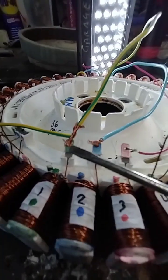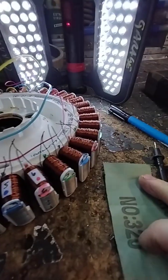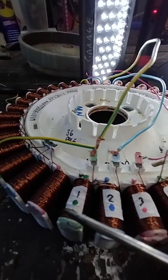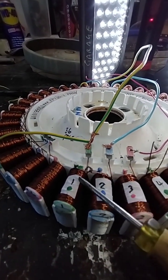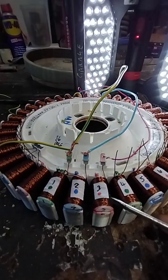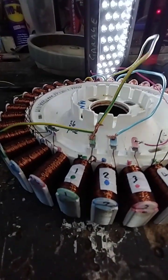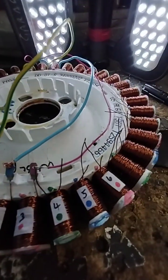What we need to do is twist the left hand side of each coil together, and that is what we've ended up with here. We used 320 grit sandpaper — you can use 400 grit — just some fine sandpaper. At our starting point, coil number one has a left hand wire and a right hand wire. The right hand wire runs up, the left hand wire gets twisted together, and the right hand side runs to the corresponding colored wire. In these banks of three, the red runs to red, blue to blue, green to green. We've ended up with one, two, and three all twisted together.